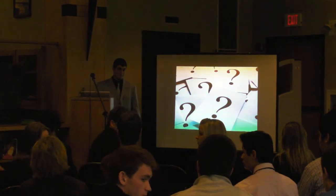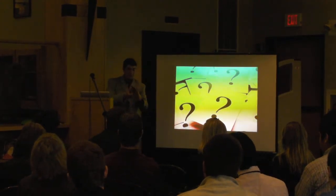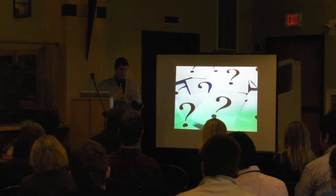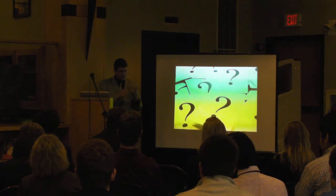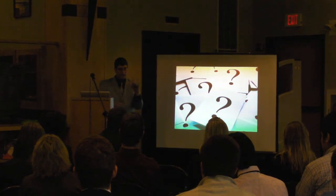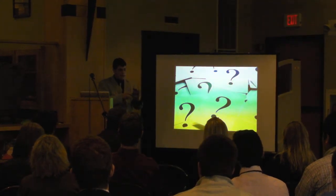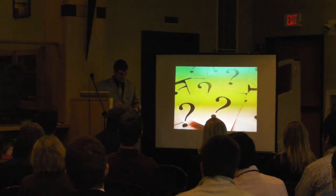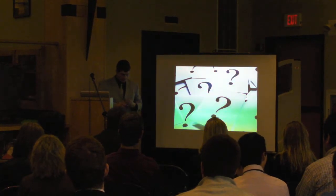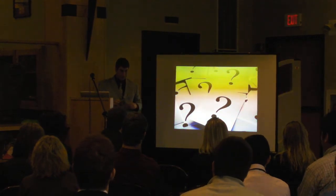Question: Can you put it on and explain exactly how it's going to work? It actually goes over the hand just like this. I'm currently trying to get him into my house so I can finish this. What's going to happen is I have a little cloth sheet that goes over his pinky, it's going to attach to this loop here, and when he closes his pinky it will pull out the cable, which will close this. I need to put a bungee cord on the back of it to keep it open until he wants it closed. It's simple and effective, not aesthetically pleasing, but there are a few modifications I have yet to make.